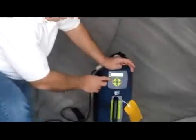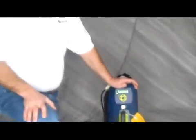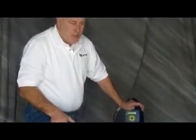Another thing that might happen is let's say you're getting these leak readings — 1, 2, 3, 4, 10 — and you're just not sure. Go into the unit again, press those two arrows and then press escape back out again, and it's going to run through a purge cycle again. When it purges, it's going to zero it out again.